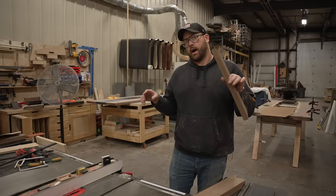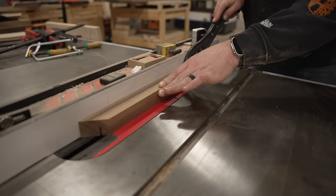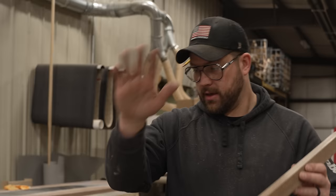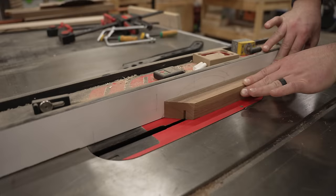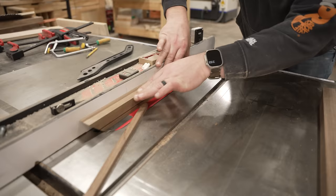So looking good. I'm gonna touch this up by hand. I know I said I was gonna pour epoxy. Bear with me. We're gonna build the top frame first. That way I can create a reveal on the dado that the whole top will sit inside. That'll match the epoxy. It'll make sense here in a moment. So I'm gonna cut these relief joints and cut my dados out here. After that, I'll drop my panel in.